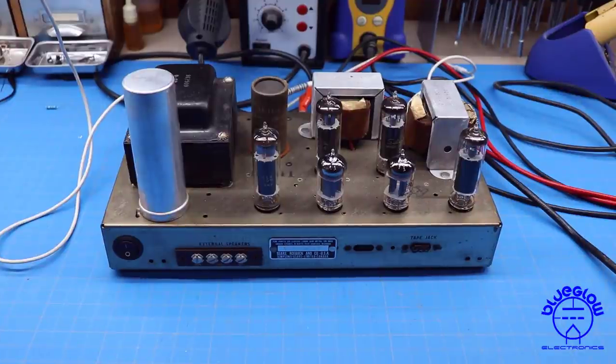In Part 4A we did some troubleshooting on a single-ended amplifier, and there are things I showed in that video I'm not going to go back and show in this one, so please watch 4A. I covered some basics of the equipment I'm using and isolation transformers. I also misspoke and quoted the pin out for a 12AX7 for what was in that amplifier — a 6EU7 on the front end. The 6EU7 is kind of a 6-volt variant of the 12AX7, and I quoted the wrong pin. I apologize for that.